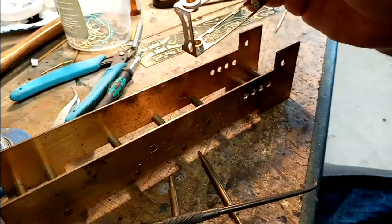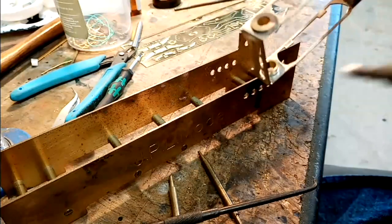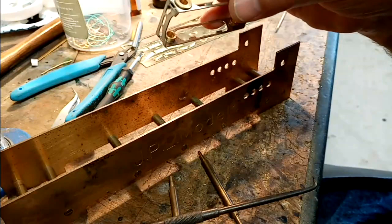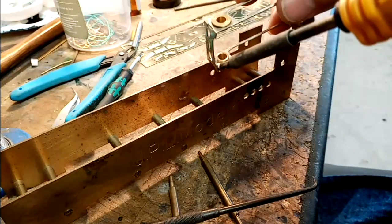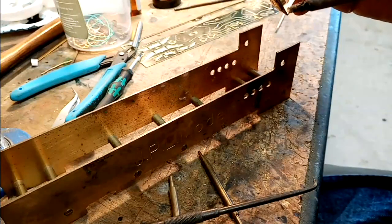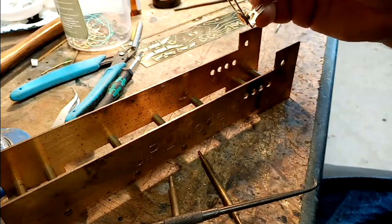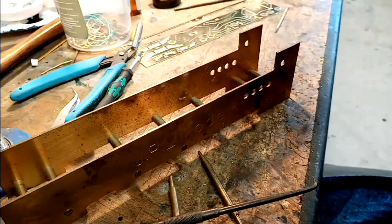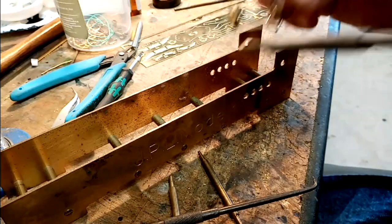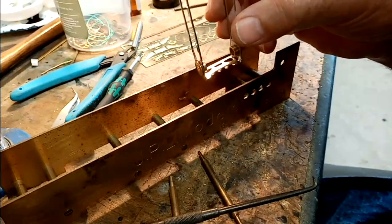I would say a wonderful thing is a temperature controlled soldering iron. I think so anyway, because it never burns the tip out. This runs at 350-375 degrees, and I think I mentioned it before, I always use 145 degree solder as my basic solder. I do use hotter solder sometimes if it's really necessary, but I've generally found that 145 is perfectly adequate for what I'm doing.